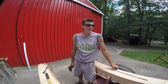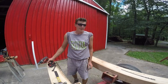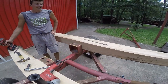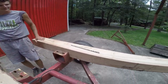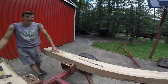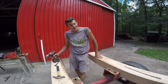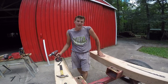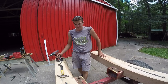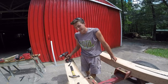You guys missed out on a lot of deconstruction and a little bit of getting started here. We're starting with our anhydrous gear, trying to get some wood on it. We're using six by eights, six by eight across the top. I didn't necessarily need eight tall, and I went with a very heavy beam just because I know how we end up treating our hay wagons. They don't get inside as much as I want, so it gives a little bit of extra material in case it starts to rot away - enough for some structural integrity, hopefully.